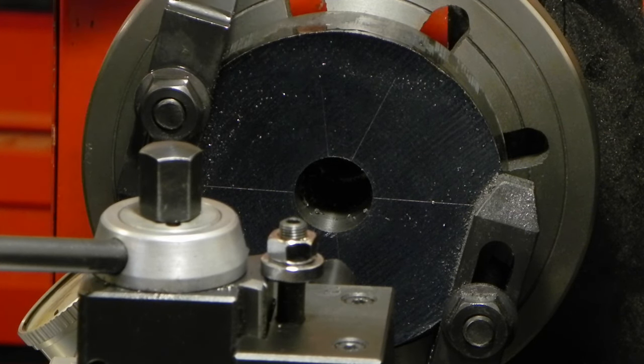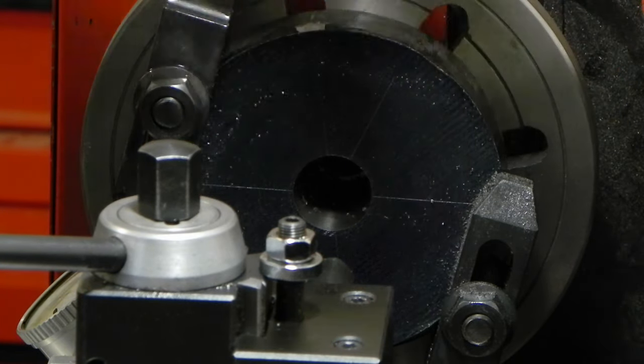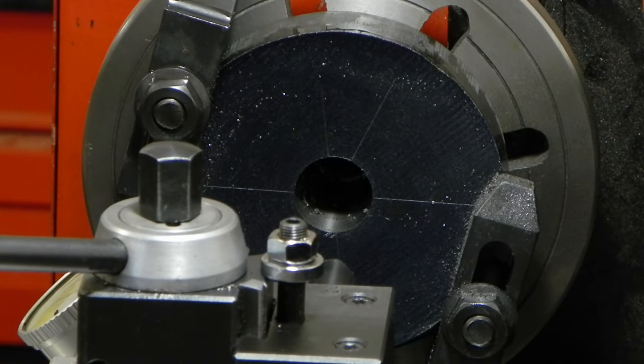The through bore is complete, so the next step is to mill, or I should say turn, a recess that's as wide as possible and just deep enough to get a completely continuous cut. That's going to be used as a reference surface for the step after this one.